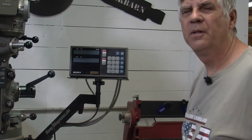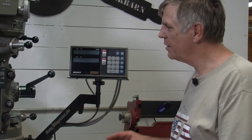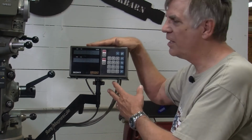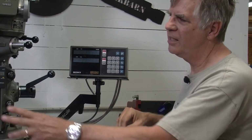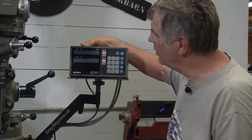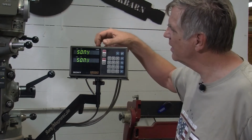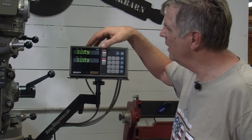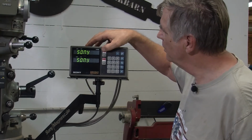All right, in this video, we're going to talk about how to locate yourself on the part. We're going to talk about the digital readout system, both the XY system that we have with the Sony and the Mitutoyo Quill digital readout. Anyway, when you come up to the machine and you turn it on, you'll see a display like this, and Sony should be blinking. And just come up and hit reset, and that kind of gets things alive.